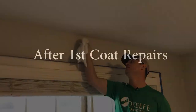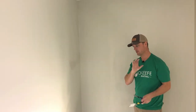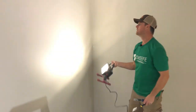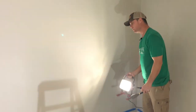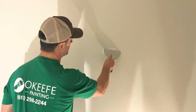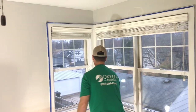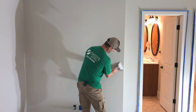Now that we have our first coat of paint applied, we're going to take care of our drywall dings and nail pops. Really examine the walls for any defects before applying the final coat. If you're only painting one bedroom, take care of all repairs including dings and nail pops before you first go to paint, so you don't have to wait on anything to dry. Take a light and check over everything — get it shining at about a 45-degree angle on the wall. I can see some holes here. All these are going to get two coats, pinned tight, wiping it all off. I don't want to have much sanding. If I see anything raised on the surface, I'll take my knife and pluck it off.